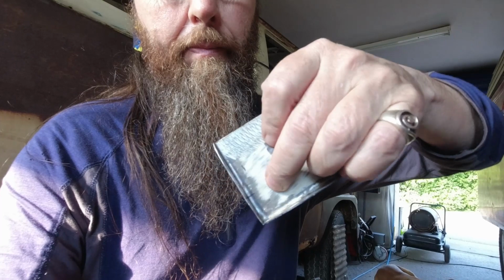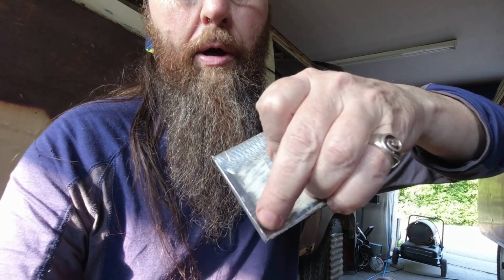We could do internal welds down here. If we fitted it now, we could put the weld into that corner. Welding into a corner is never really a good idea. It can be done, no problem. But like I said before, you always think about the things beforehand, and if you can avoid welding into a corner, it's probably better. In this instance, we have it in our hand and it's as well to weld it while it's out and then just polish it up, clean it up, dress it up and then fit it. It's sealed then.